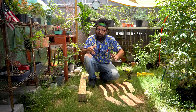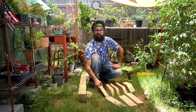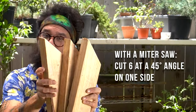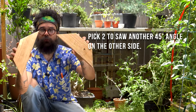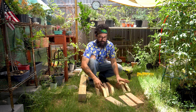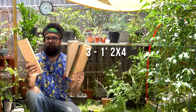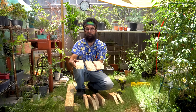What do I need to make this movable monkey pole? You need a 10-foot long two-by-four. Cut it down into nine one-foot-long sections. With four of them, cut a 45-degree angle on the end — this will be the foot of the monkey pole. Next, take two of your one-foot sections and cut two 45-degree angles on both sides — this will act as our support on top. The remaining three one-foot sections you just cut from the two-by-four, and these will be spaced out so that we have a square foot on top.